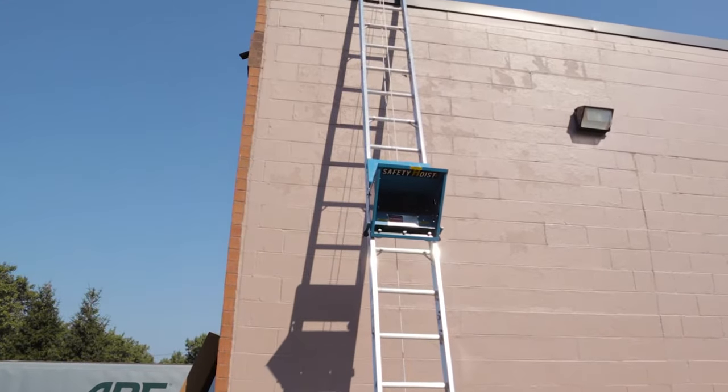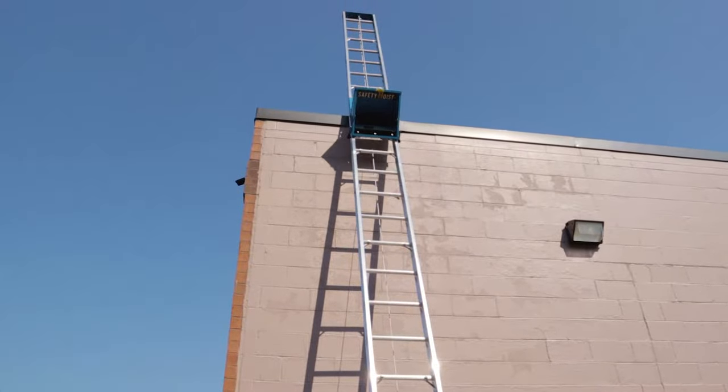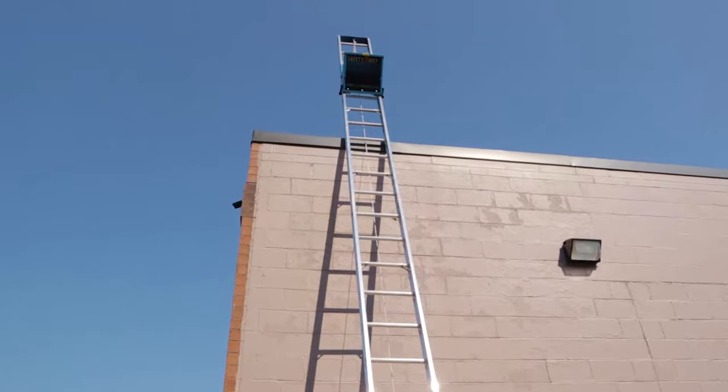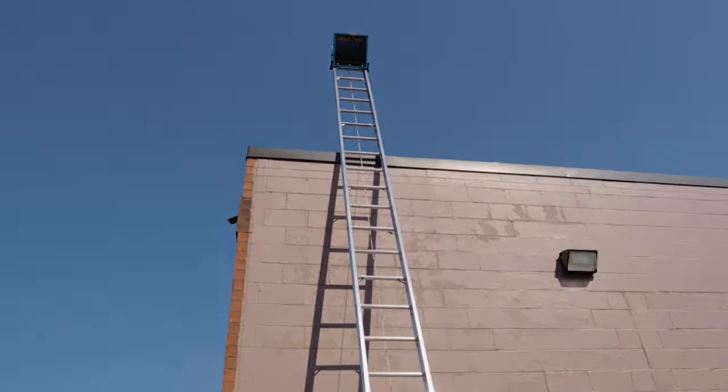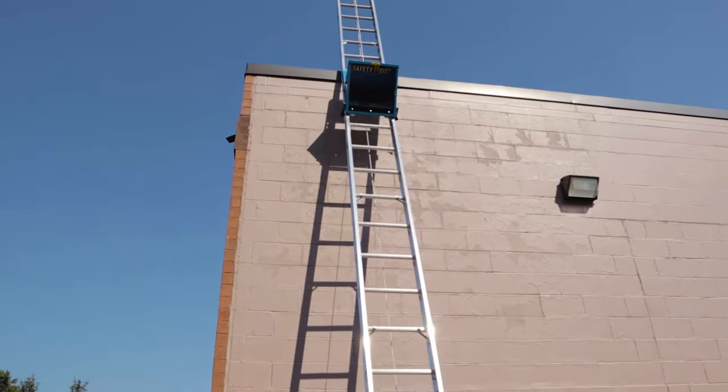Press the up button on the pendant controller to lift the carriage up, and press the down button to lower the carriage. As soon as the carriage hits the top or the bottom, be sure to remove your finger from the button to avoid cable crossover. Run 2 trial runs to get used to operating the hoist.